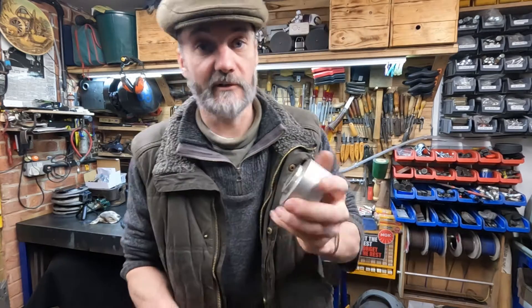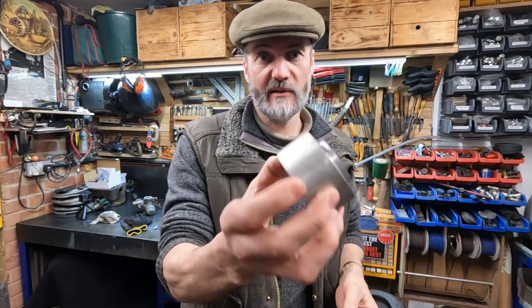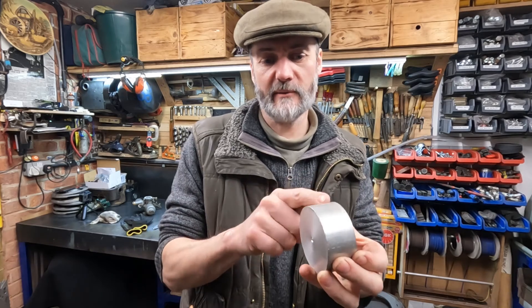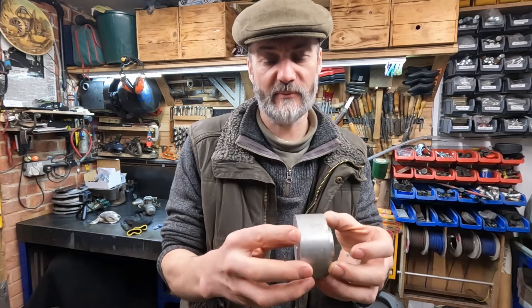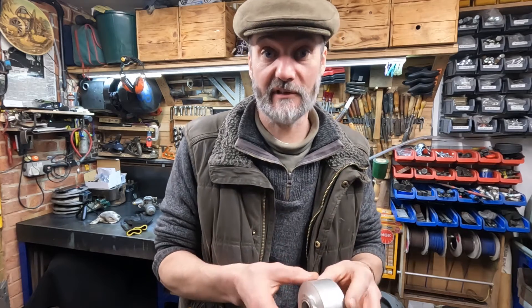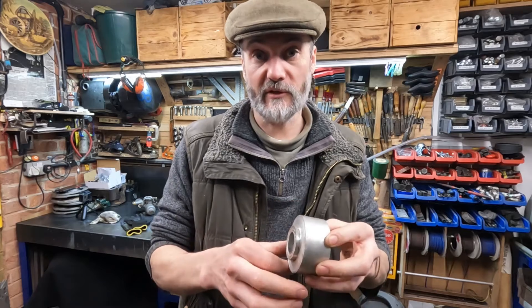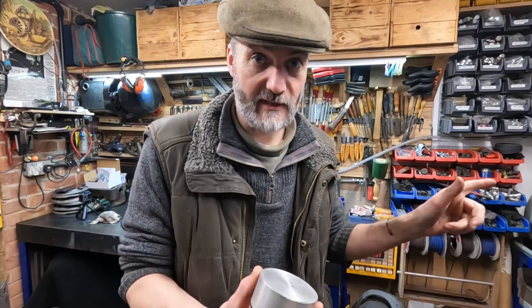Turning away from the camera, which I'm trying not to do — it's very hard — we're going to be machining this aluminium block up on the lathe. We're going to be machining that flat and I'm actually going to put some indents in it with the cutoff tool just to aid cooling and basically to make it look nice when it's on the car. So we're going to machine that, put the lines in it, then we'll polish it, wrap it up, and then we'll do the centre bore. So over to the lathe.